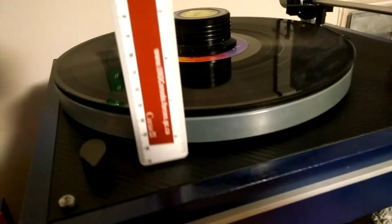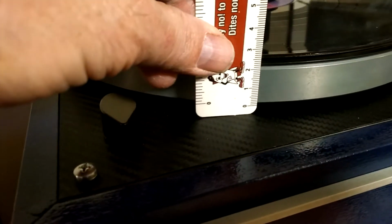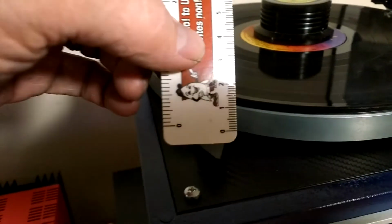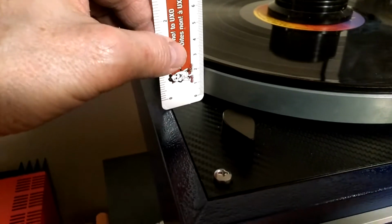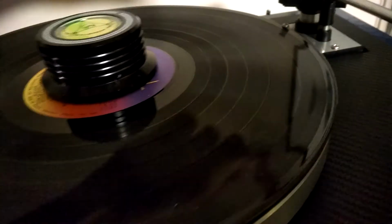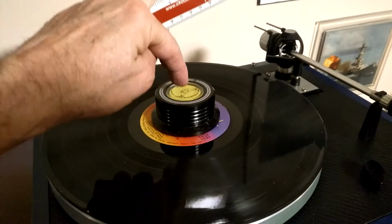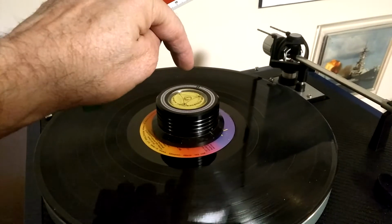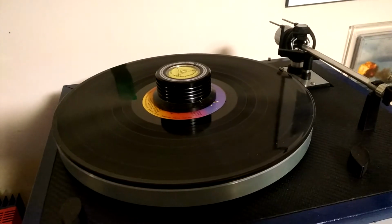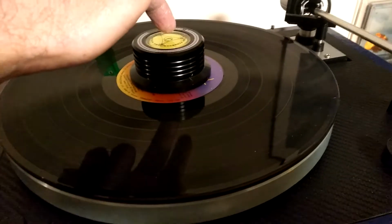What I've done is I usually go around and make sure it's the same height all the way around from the top of the top plate. In this case, given there's about a 5 mil space on the bottom, I go up to 1 mil. So it's about 6 mils off the top plate, and lo and behold, it works every time. It just acts like a piston. Just works perfect. And then it just sits there and bounces for about 30 seconds, 40 seconds at least. So I think I've got it all tuned up.